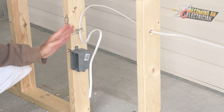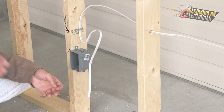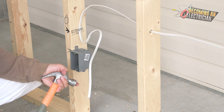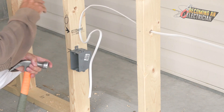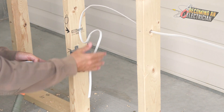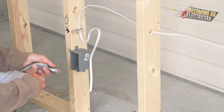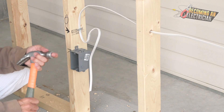Remember that in electrical work it's all about doing one task over and over with the minimum amount of tools. Right now we're in the wire-pulling stage — drilling holes, pulling wire, and stapling. We're not cutting the wire yet. The next stage is called cutting in: stripping the wire, putting it in the box, splicing, putting on wire nuts, and bonding. That comes next.